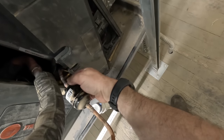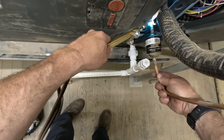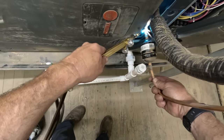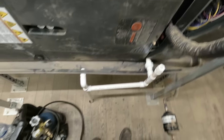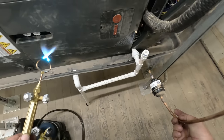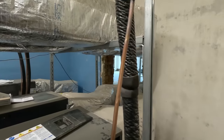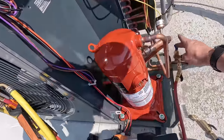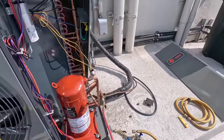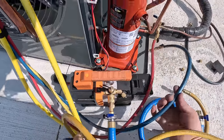We'll pull it away as best we can. Let's see if we can get in here without melting. I'm going to go to the inside piece - we'll get an extension copper so we can get the stupid thing removed. Like that - you can see the nitrogen's flowing. I've got a crappy connection right up here so we're going to go ahead and chop that out, put the dryer up here. It's still coming through, which means it's actually able to make it through the filter dryer. Let's go ahead and do a pressure test real fast, see where we're at.